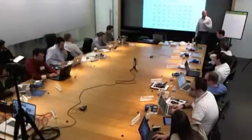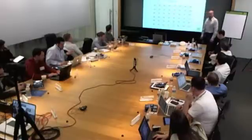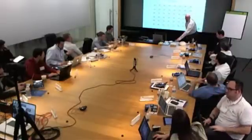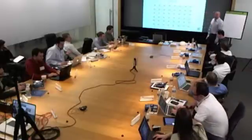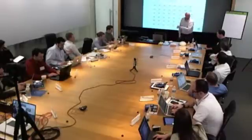So I guess you're just using dual radio APs there. Excuse me? You're just using dual radio. Dual radio APs, yes. One for 2.4, one for 5. And we can also support, in a meshed environment, using one radio for the link and the other radio to support the clients. Or on a repeated mesh, as we saw earlier, you can use radio to radio and get better performance out of that, because these will operate in 5 gigahertz. So you could have 2 5 gigahertz radios running on one AP? Yes, we can. On the 466 only. And that would be this one and the outdoor version of it.